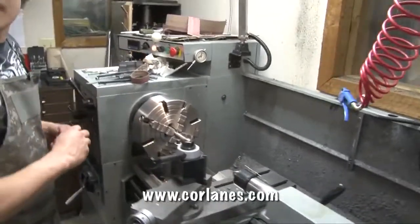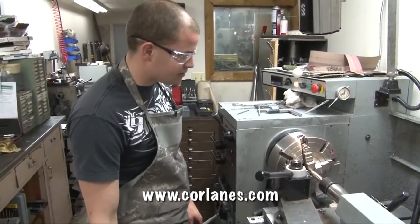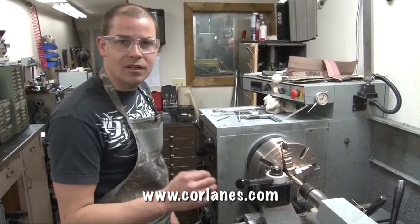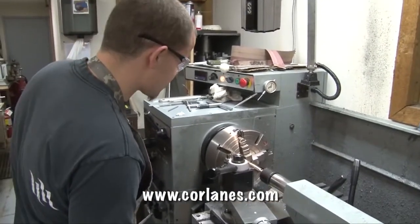So now we're going to contour to match the profile of the barrel. I changed my lead angle to 13 degrees — just seems to be the happy medium we like for just enough taper, but nothing too long, nothing too short. Nice polished edge. So we'll match that up and see how the finished product looks.